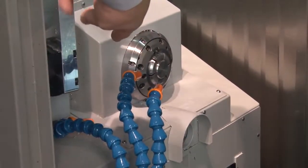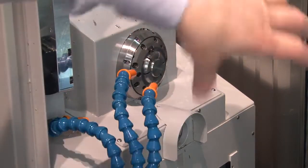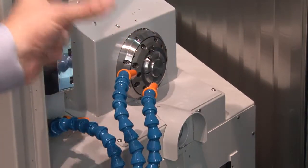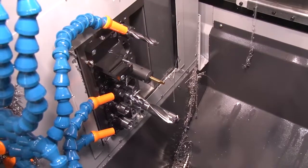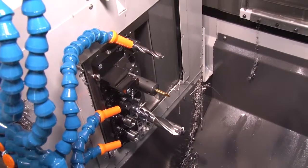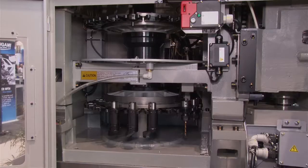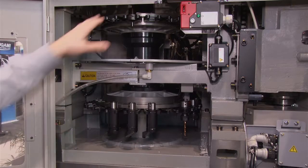Right here is our actual guide bushing — this is in Swiss mode right now. This actually has an integral guide bushing that's removable. You can actually remove the guide bushing and move the headstock completely forward into chucker mode, and you get four inches of overall stroke in chucker mode. Another great feature of this machine is the backworking tool block, which is more like a standard Swiss machine. This allows us to have five driven tools and five static tools to do some overlapping with the sub-spindle while the main spindle is machining the part on the front side. Another great feature is the capability of 40 Capto C4 tools on a dual carousel system — 20 up top and 20 down below. Please follow us on social media and visit our website at www.remsales.com.